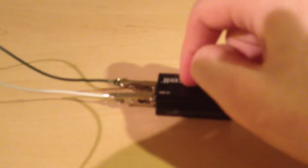Okay, so for my cable testing project, I've got my circuit set up with the current flowing from the negative terminal of the 9-volt through this green cord to my green LED, through the red cord to my resistor, which I've calculated out to be 450 ohms of resistance. You can see the color code there.